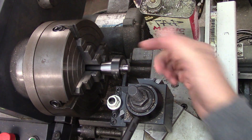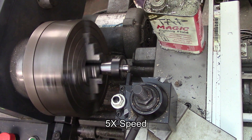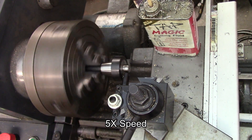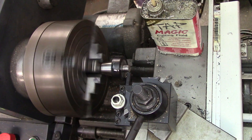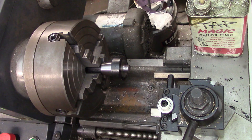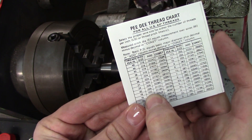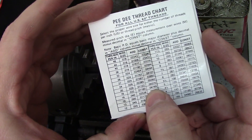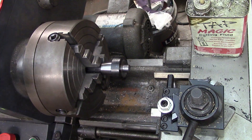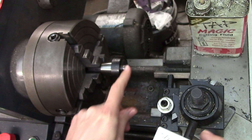Pro tip: in instances like this where I'm threading right up against the shoulder, I'm looking at the left hand side of the tool — not looking at the threads at all. That was about 69 thousandths in and they're starting to look like threads, so I'll take a measurement. This is 5/8-18, and my threading chart says I should use the 32 thousandths wires. The constant is 0.04789, and that's the number I added to my pitch diameter range to get my measurement over wires. Those are the numbers I'm actually looking for when I put the three wires on the thread.